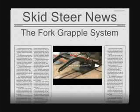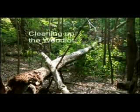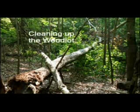Installation is easy and straightforward, and with up to 7,000 pounds of hydraulic pushing power, built from heavy gauge steel, there's no job too big or too small for this product. You just slide the Pomco fork grapple system onto your standard 4-inch wide skid steer forks, hook up your hydraulic lines, and you're ready to take on any size job. You can move boulders, plant trees, remove trees, lift logs, remove tar and cement, lift hay bales, move industrial products around a construction site, and much, much more.